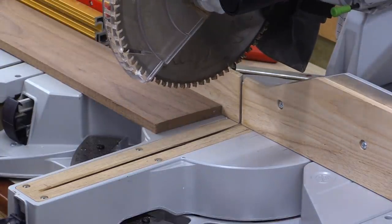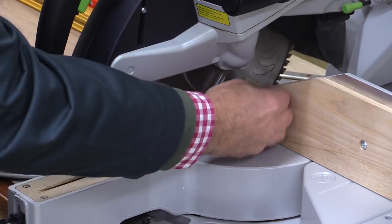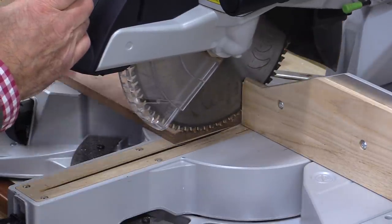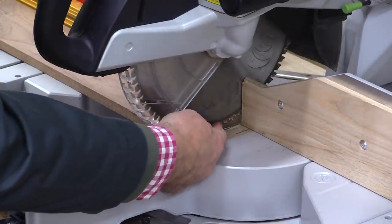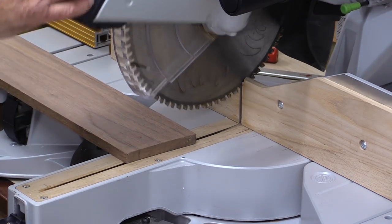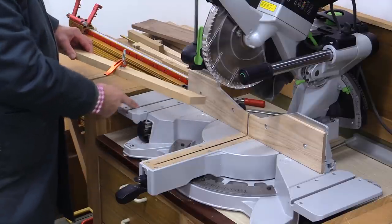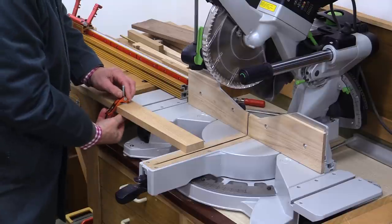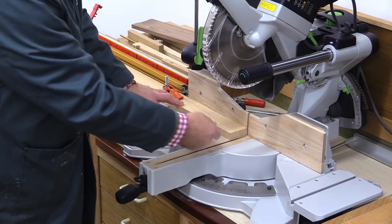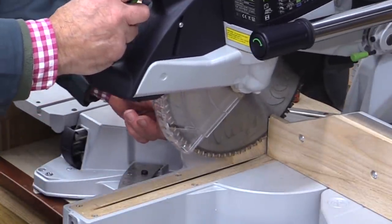There's something else to remember about doing trenching with a mitre saw. I've got the saw set in the normal cutting position, so it goes all the way through and the blade passes all the way past the rear fence. If I engage the trenching stop and go all the way to the back, the saw may well be cutting at its full depth at the front, but at the back it's not. So when you're doing trenching cuts with a mitre saw, you need to bring the stock forward. I've got a piece of wood kept specially for this purpose — because I've got this little groove here, I can fix it onto my saw, tighten this up, and now when I do my trenching cut, the bottom of the saw will definitely pass all the way through to the back of the piece of wood.